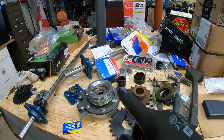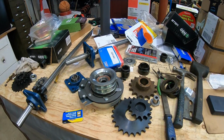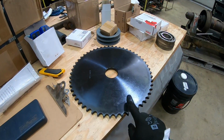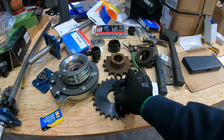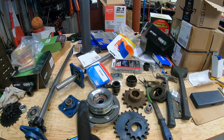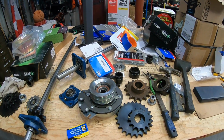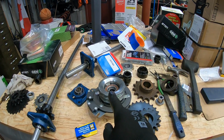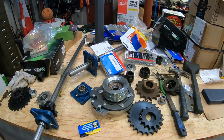I've got 2 of those, one here, and while spinning the main shaft coming from the PTO with that gear, I'm going to spin small sprockets like this one on 2 shafts, but they are going to spin in different directions using a threading of the chain. Both shafts will be going in reverse directions, and whichever clutch is engaged is going to define the direction of the spin.